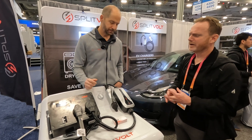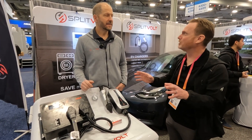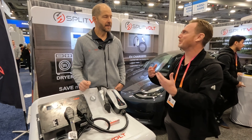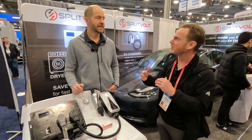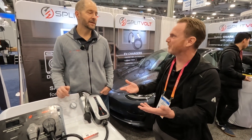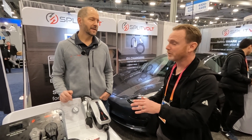It's very safe and automatic. A lot of people, when they first get their EV, they're trying to get the most power into the car as quickly as they can. I actually recommend — and I do this repeatedly when we review chargers — charge as slow as you can. I usually charge at like 24 amps, 32 amps, although the car can take more than that, just because I don't need to. And it's better for the battery, it's better for the grid. There's just so many reasons to go lower power.